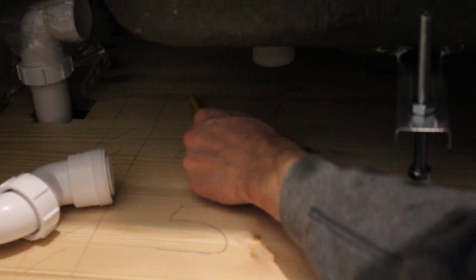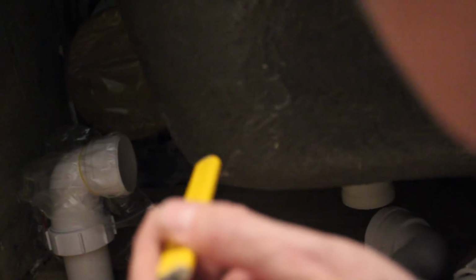This little area here, I might have to cut away, because the actual bath waste, if I do push this in here, it lifts the bath up, so there's not enough clearance. Remember, the normal rule of thumb, I could raise the bath about 10 mil, which might possibly be a more sensible thing to do, but at the same time I've got a soil pipe here, so it needs to be relatively low anyway. If anything, it needs to be another 5-10 mil lower. So there's no harm in taking this piece of wood out when this is fitted, because when the panel goes on the side of the bath, this will all be covered up anyway.